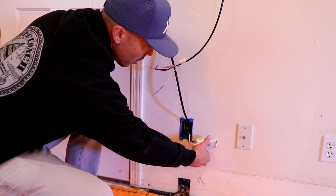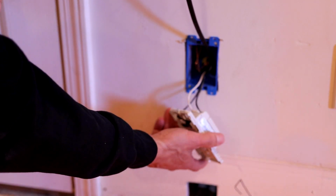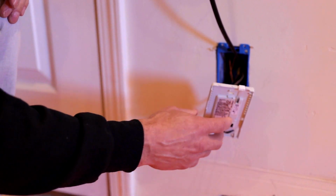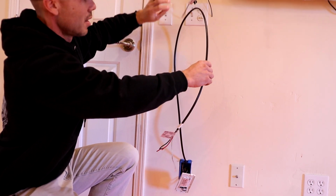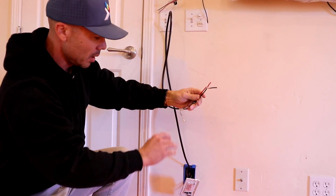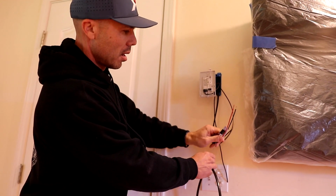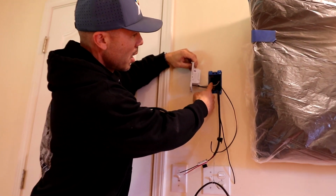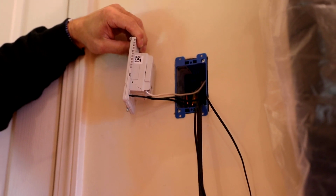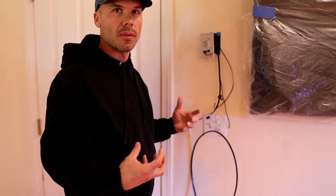And both of these, again, have their own. These are 240 volt circuits. These are the hot lines going to the panel, back to the breaker box. And then the lugs on the top are going to be our leads, which here we have. Oh, we just have it around. It's just up off the floor. Yeah, we're just keeping it up off the floor right now. But yeah, so the leads will go in on the other end of the hot side. And same thing with the thermostat. Here's our floor leads coming up for the other cable. And then we already have our hot line, our in line going back to the panel. So yeah, we wired these up 240 volt, 20 amp circuits. That's going to give us the juice we need to power up this floor, because it's going to take quite a bit of power to power all this.